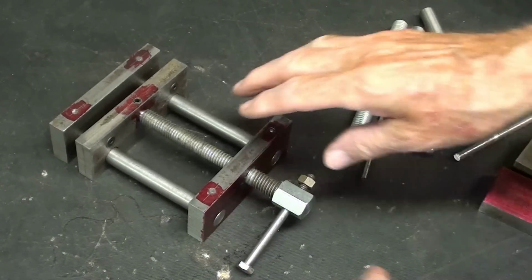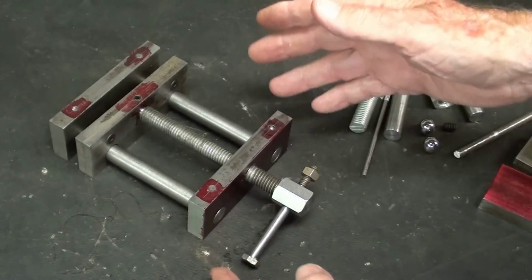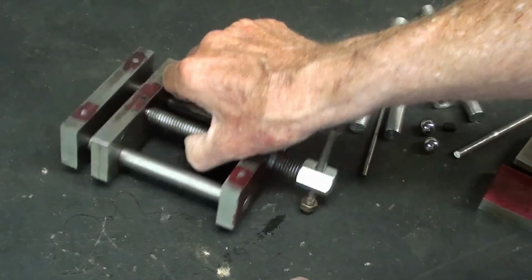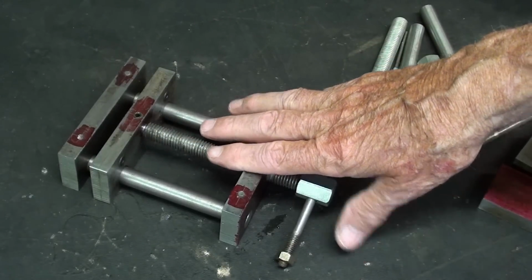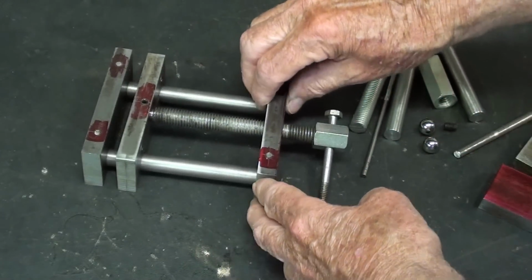I recommend you use a milling machine to drill these 3 holes rather than just a drill press. If these holes are not parallel to one another in both axes, it will bind, it will not work. Really way too difficult for freshmen or sophomores to make, even though it looks so simple.